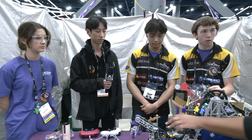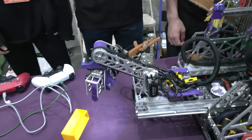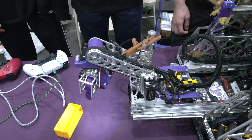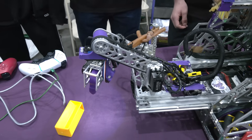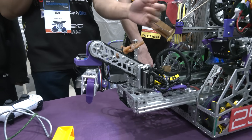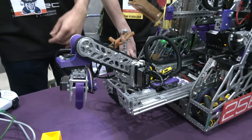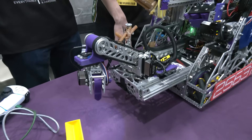With the counter-spring and the rubber band — was this something you counter-sprung from the beginning, or did you start with no counter-spring and find it was too slow? We knew we wanted to counter-spring from the beginning since we're basically at the servo limit — we knew we could only have one servo on the arm. Since our arm is somewhat long, we knew we'd have to counter-spring it to make it fast.